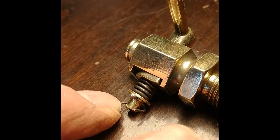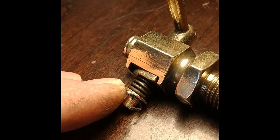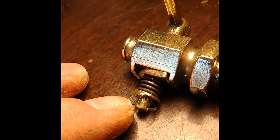Polished up. Somehow I lost the washer, so I had to get a number eight brass washer and then ream it out just a little bit, and a new cotter pin — 3/64th — which are a little hard to find.